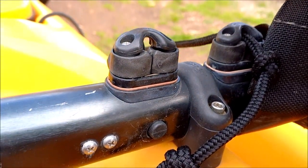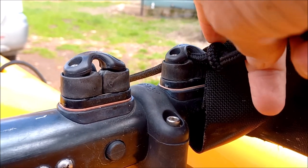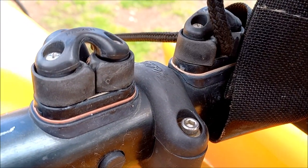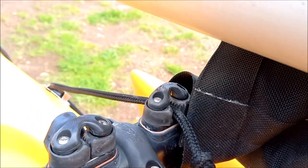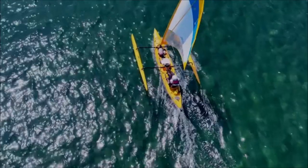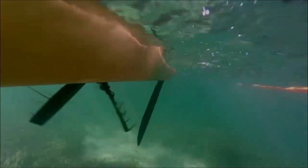Cleats are really simple to use. If the rope is sitting in the top section of the cleat, it's loose and will slide in or out easily. If you want to lock the rope, you pull and drop it down — these jaws grab the rope so it won't pull through. That way it's locked, so that's cleated. If you want to uncleat it, lift it up and it pops out — that's uncleated. When the rope's under tension it may take a fair bit of effort to uncleat it. That's probably clear as mud, but you'll figure it out once you're out on the boat. Next video will be how to sail.